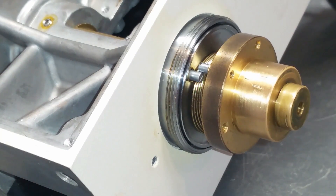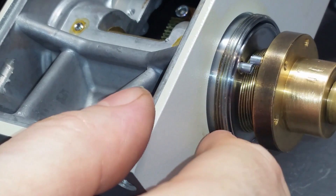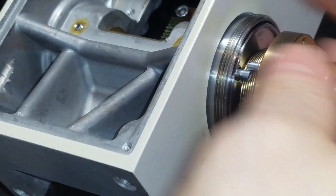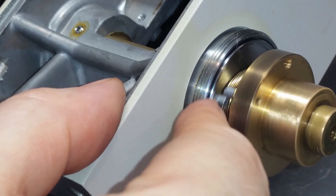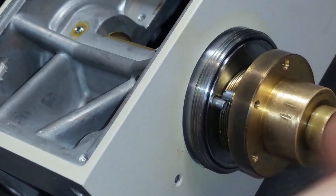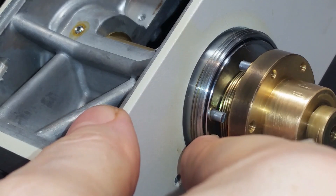I hope that gives you a pretty good intuitive understanding of how this lock mechanism works. It's really a pretty clever mechanism — whoever came up with it must have been some kind of a genius. There's just a little bit of squeak on there because when I put this thing together I just slapped it together, handled all the parts, and there's skin oil and grease from the mechanism on these parts everywhere — that's what's causing that sluggish noisiness. So when you put these together for real, you need to make sure that everything inside there, all those sliding surfaces, are surgically clean with no skin oil or anything. Otherwise you will potentially end up with that issue.